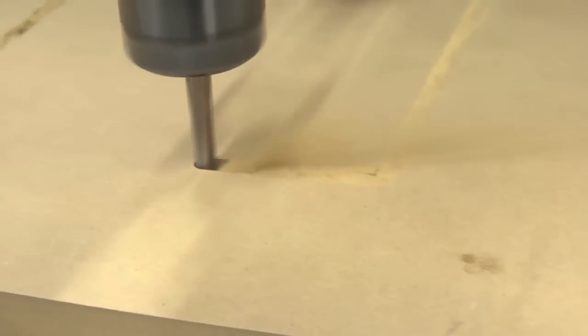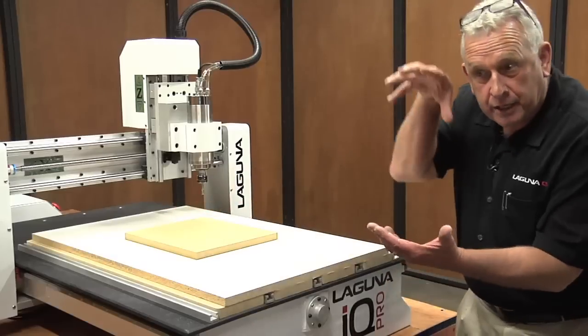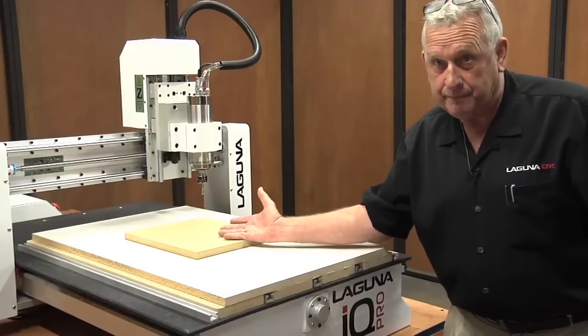The second program is going to machine the backside. It's just really going to do two things. It's going to cut that pocket, and that pocket then becomes in the end where the picture goes, a ledge for the picture. And then we're actually going to define the perimeter of this so that now we can line that up with our table, and we flip it over, the front and back line up.